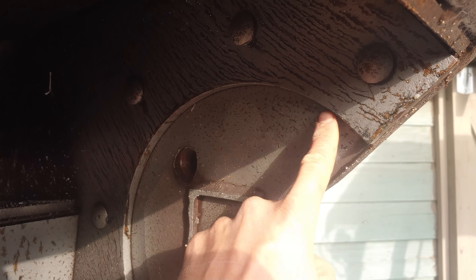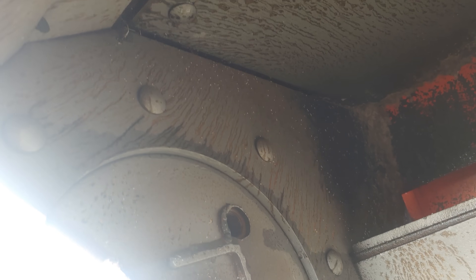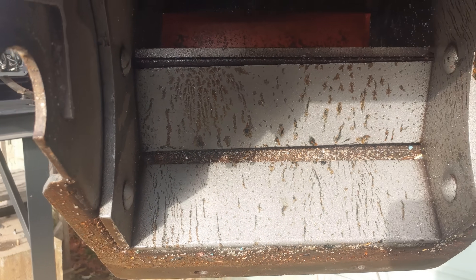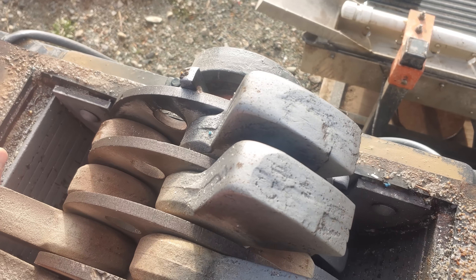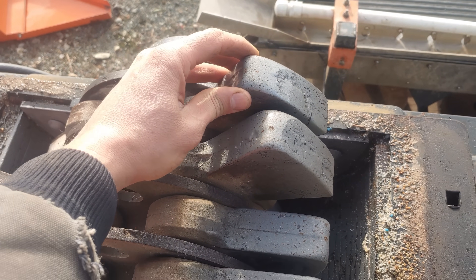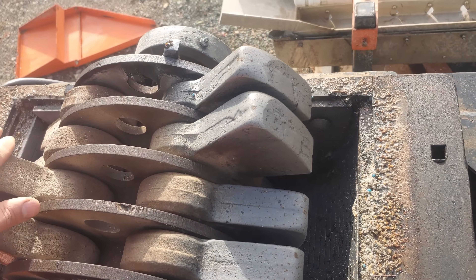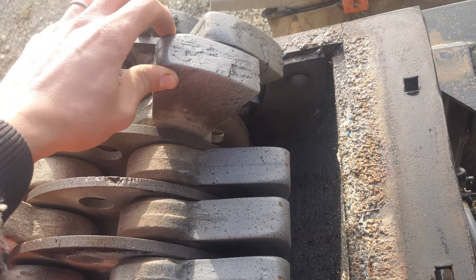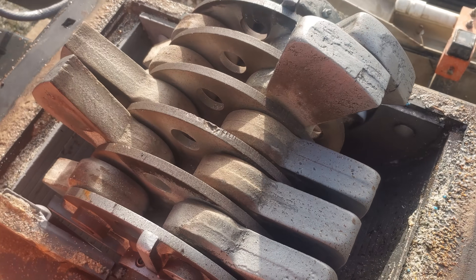There's side armor here that is all bolt-on and replaceable. It comes really pretty clean — I was running this yesterday with some gold ore and it's not like there's a bunch of sand and muck stuffed up in there. Here's the rotor assembly of the mill. This is the wear surface of the hammers — these are fairly new, I've probably run maybe a couple tons through here, but you can see they don't wear very fast. I'm going to get 20 or 30 tons out of this set of hammers before they wear out. When the leading edge shears down and rounds, you can take the hammers, turn them around, and get a whole other surface. Run for 15 or 20 tons, turn the hammers around, and get another 10 tons out of them.